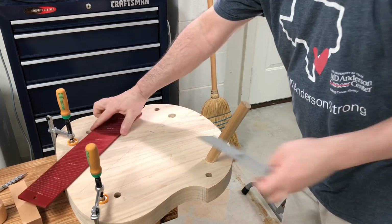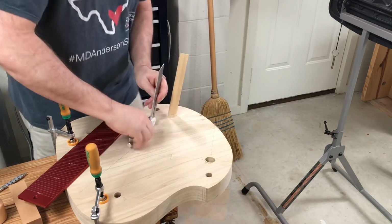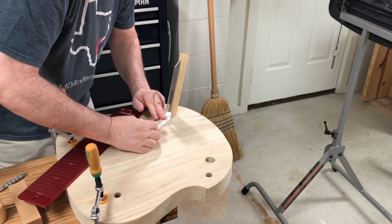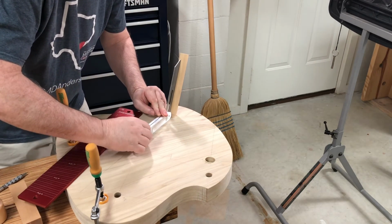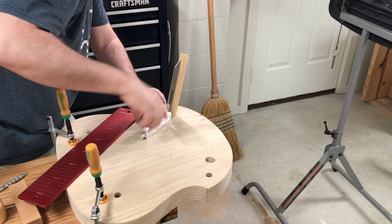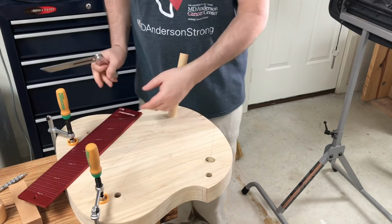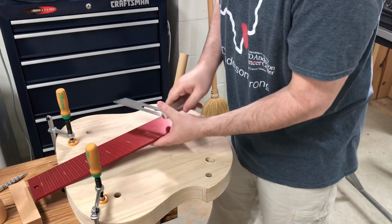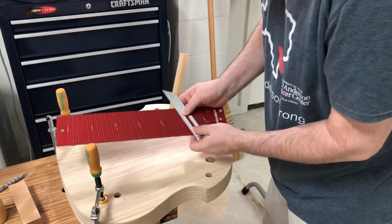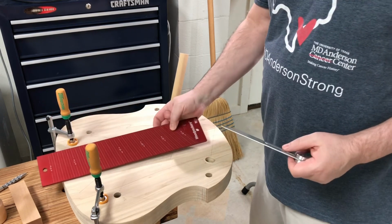But you say, oh, that's only one of the holes you ream, so how about the other one with the other technique? So let's take a look at that one too. So we line that up, lock the bevel gauge at that angle, making sure, yeah, and we line that up with our gauge here, and sure enough, we're at 24.5 degrees. You can't ask for better than that, and it's just that simple and that accurate.